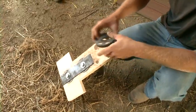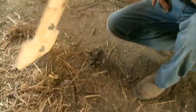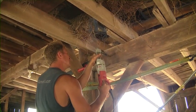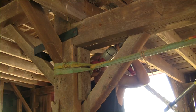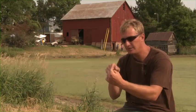A shear ring is basically a steel ring that has a hole in the middle and comes with a special cutter you chuck into a drill. Once you've got your pilot holes drilled, you put your bracket on from the outside, mark your hole locations on both sides, then drill your pilot hole from both directions so they meet in the middle. If you come from one direction only, chances are you won't meet up with the hole on the other side and your all-thread won't work properly.